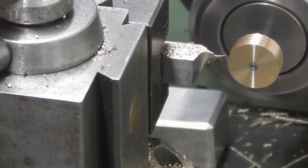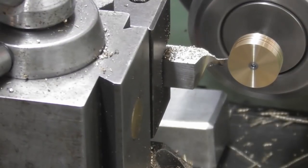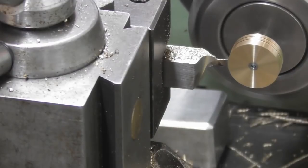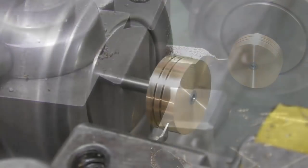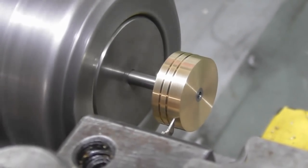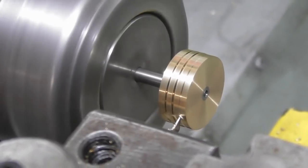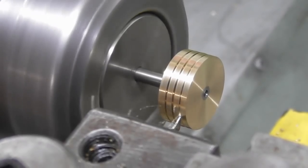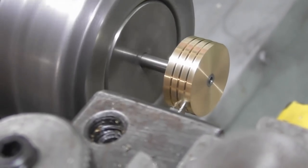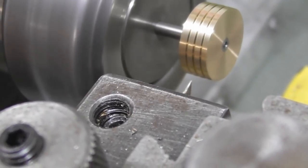So I'll just take the tool using the DRO to the next position for the 3rd groove, and I'll see if I can bring you around the other side to show you this. But yeah, it's absolutely tiny. So I'm going to try and keep you as still as I can, guys. So that's 15 thou wide, that blade. We'll go into a touch, which is there. 15 thou deep groove. There. And back out. So there we have it. That's the 3 oil grooves.